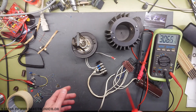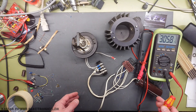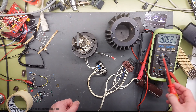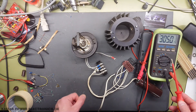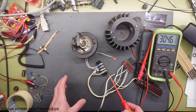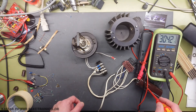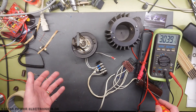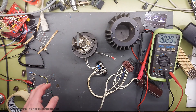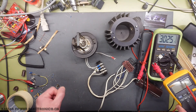For the test setup, I have used a regular full bridge rectifier and an electrolytic capacitor for the DC bus — 1000 microfarads at 450 volts — because I will only go up to 310 volts. Right now it's charged to 305 volts from a variac. This only needs a start pulse after about 20 seconds of the filament or heater being turned on, so I figure I could just charge this up and then turn the variac down to 70 volts. Let's get a line set up here for the measurement with the resistors on the other multimeter, and then test the same glasses I used out in the sun.